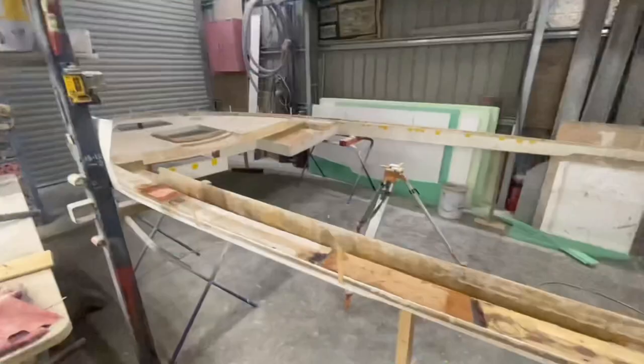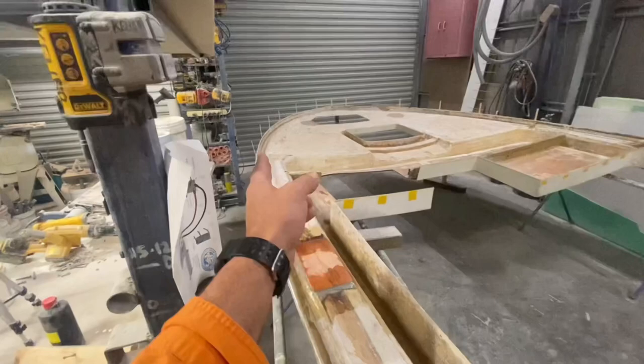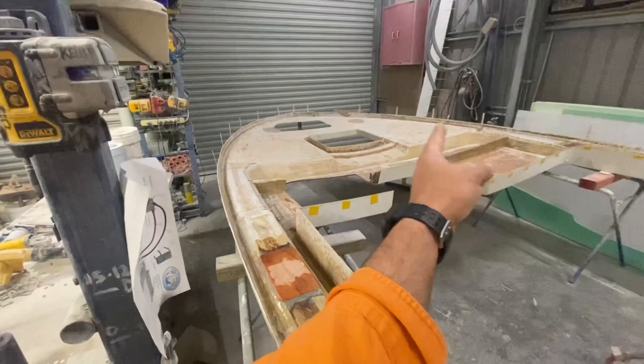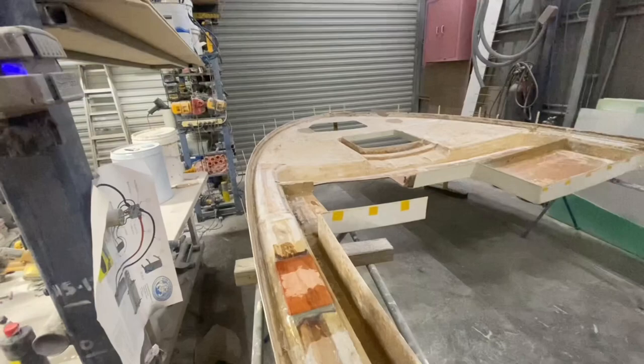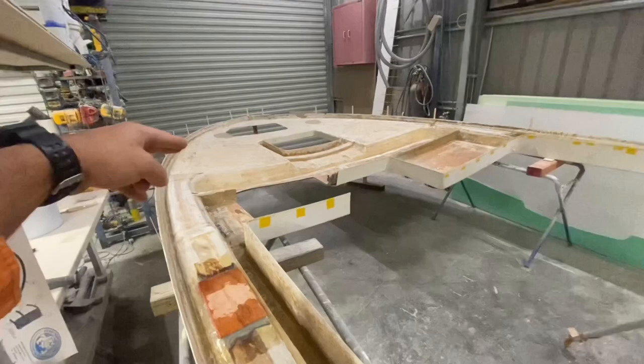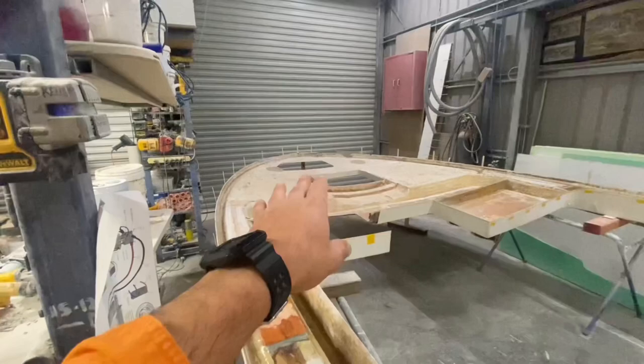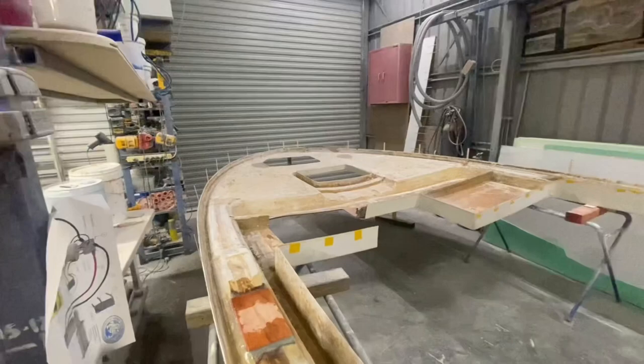This is my problem — I've only got this much Thermalite left. I want to put Thermalite down there and there so the rod holders have heaps of beef to go on. And then I want Thermalite that goes around there and around there so the bollards, if I put some bollards or a bow rail on it, it's got some good meat on it. I can compress it, and then I'm using honeycomb there, honeycomb there, and I want Thermalite along the whole front. There's going to be a divider out of Thermalite and it's a subwoofer box on one side, so it needs to be stiff and strong.